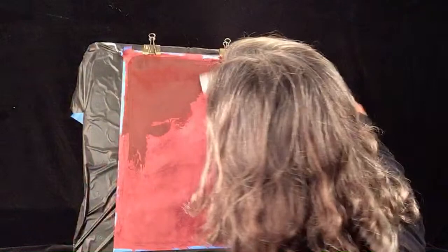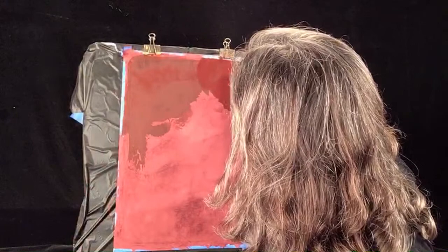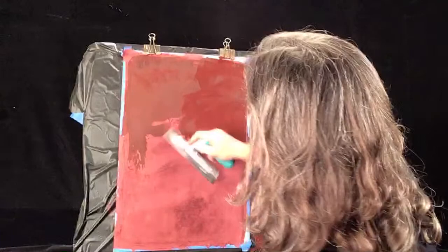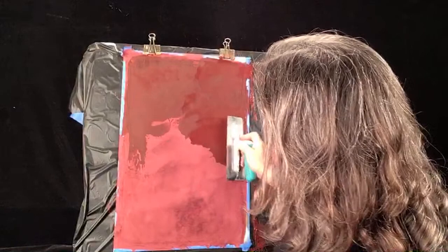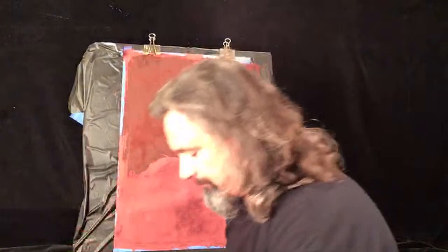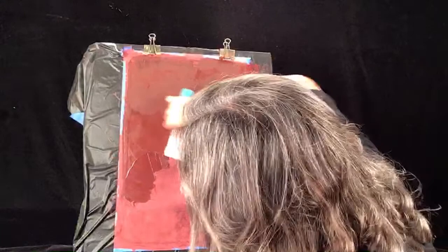This plaster covers — one gallon, two-coat application — you should get about 300 square feet per gallon, so it goes really far. When you see the prices, don't freak out because it's not like paint at all. Plus it had to come all the way across the ocean to get here. The biggest thing about plasters is they're not all the same. Just because it says Venetian plaster doesn't mean it'll give you the same results — the stuff at the big box store is an acrylic product and will not look anything like this. That doesn't mean they're bad, just that they're not the same.